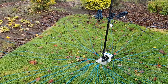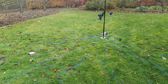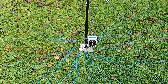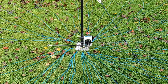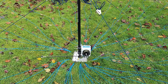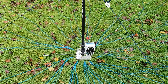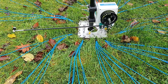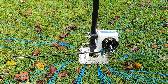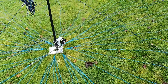It took me about just over an hour to set this up from scratch. I set them both up and then I wanted to set the center frequency for each antenna to 7.150 — I couldn't quite get that, almost. So I think I really need the 6 meter version pole for this, because the antennas are having some interaction with each other. Unfortunately the SWR isn't fantastic; it does have a dip, but the dip's just below 2 to 1, and both antennas are the same.